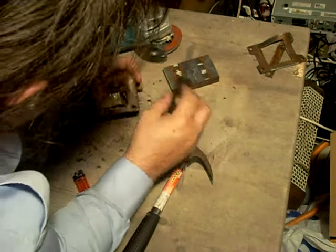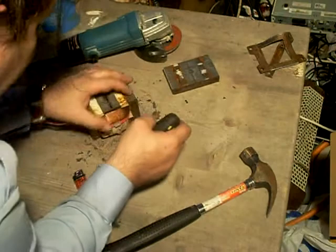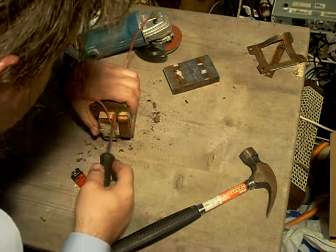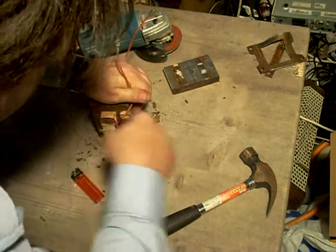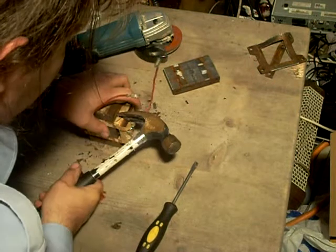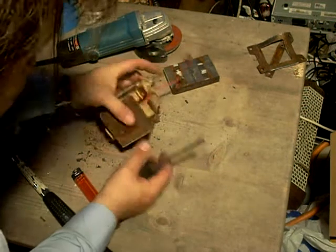Now this is where it gets interesting. What you can do is decide on the winding you like the least. I wish to keep the primary winding here, which is the 240 volt in the case of the UK. I'm not fussed particularly about the centre winding, so I will put my screwdriver levering in between the centre winding and the high tension. I think this is going to end up as scrap copper, to be honest, because it's rusted in where it was left outside for so long — the windings have rusted together. There's very little chance of getting this out in one piece, but we will still try.